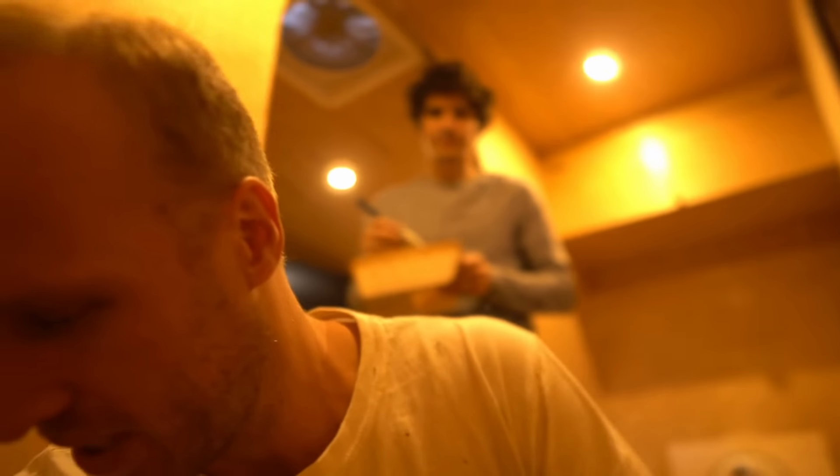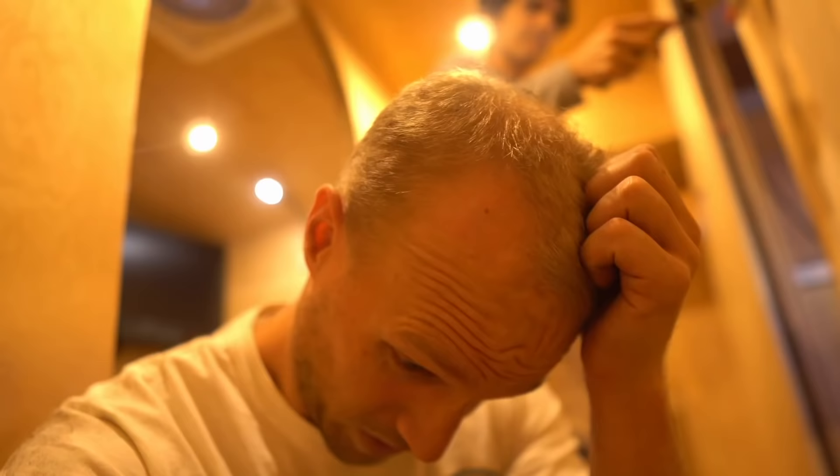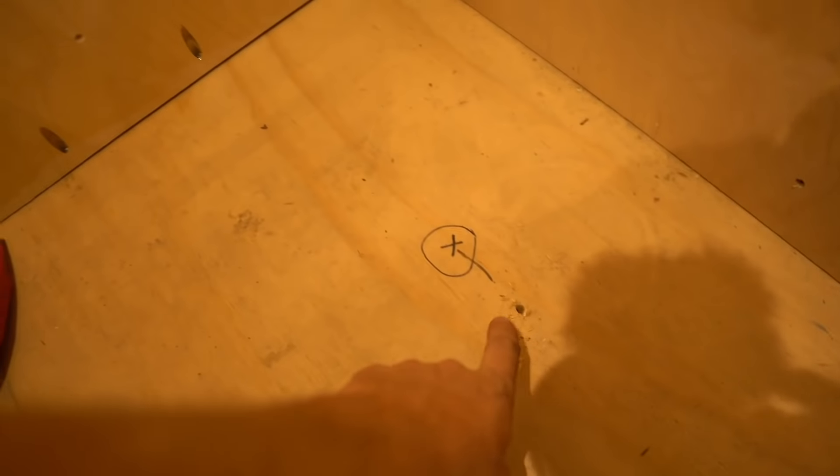I just did a thing in preparation for cutting a four and a half inch hole in this floor — that's a huge hole, never fun. Here's my location: this will be the shower drain, centered between the frame underneath the bus with no obstructions. When you map this out, odds are you might have an obstruction right in the center of your shower, which means you'll need an offset drain. With the KERDI shower base that we're going to use, it's easily adaptable to an offset drain — that's kind of why we picked it.